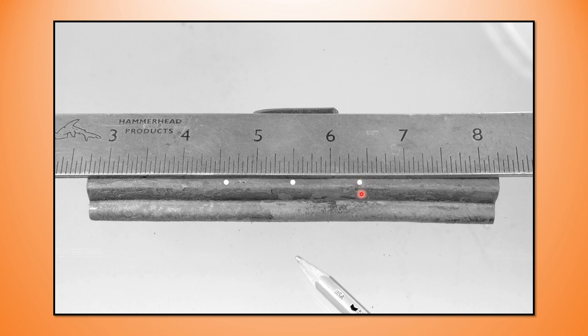I can make another mark, and you can see that my second mark here is not where it should be. It should be somewhere out here on the 15/16 mark. So I am a little tight, and this is where me shrinking my measurement starts to come into effect. I like to crowd my corners so they fit nicely when I'm fitting the collar to the grill. And so in crowding those corners, I get a little stretch on my collaring material.